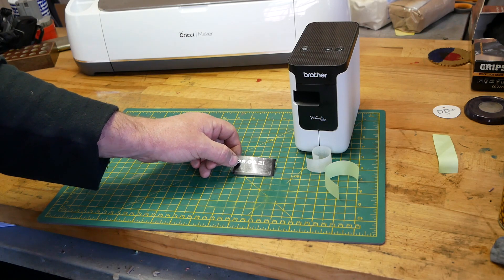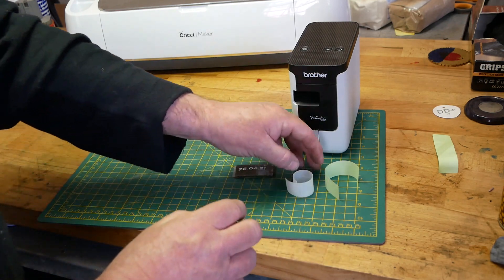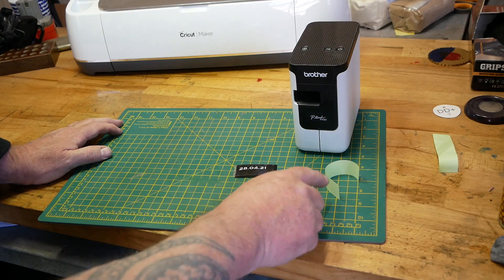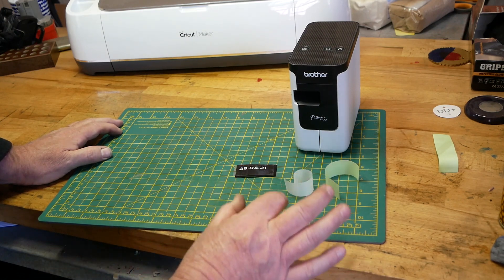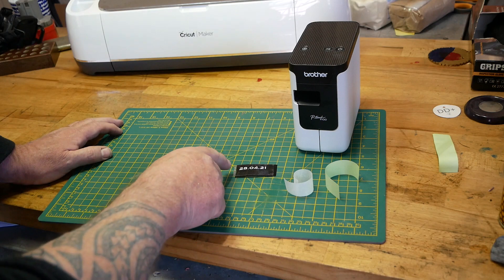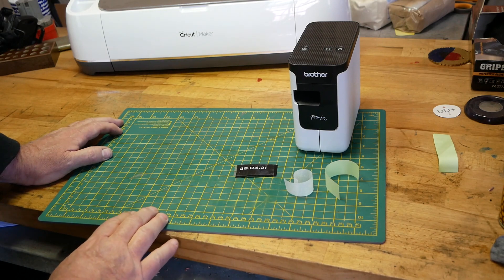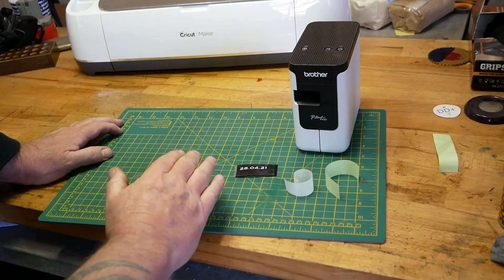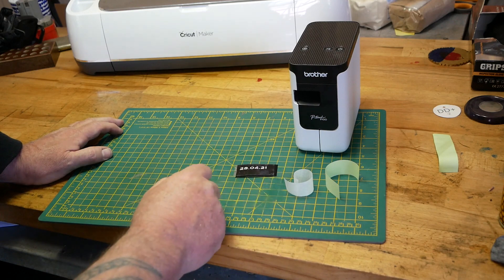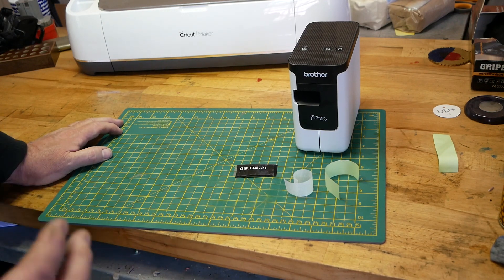The obvious difference is that with the Brother tape, I can only stick down the edges — I put masking tape around the edges to hold it down, but that will not keep it absolutely flat. One of the big problems with that is bleeding, so the edges aren't as clean. With the vinyl, if I do it properly, the whole thing sticks down including the little pieces in the middle of the numbers, so I'm likely to get a much cleaner etch. The tape also tends to burn if the amperage of your etching power source is too high.